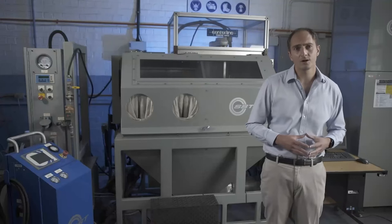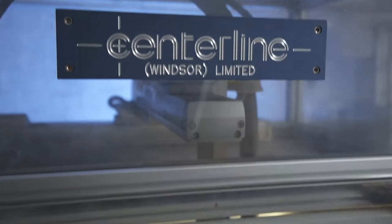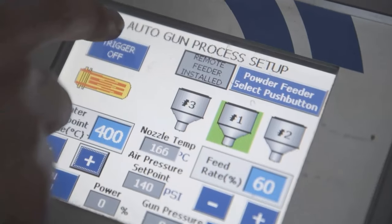At the WITS Labs, our cold spray machine is classified as low pressure. Low pressure cold spray machines tend to be better at spraying ductile materials such as zinc, magnesium, or copper, with much less wear than high pressure machines. This specific machine operates at around 10 bar, and with a pressure booster it can reach 18 bar.